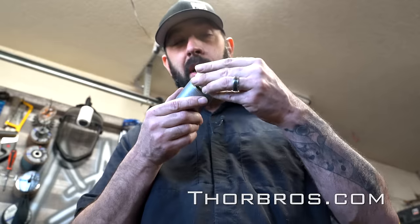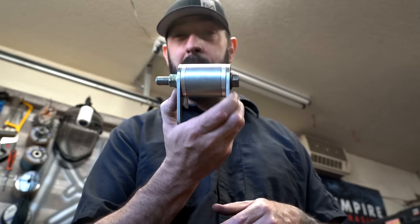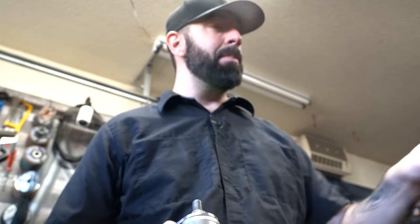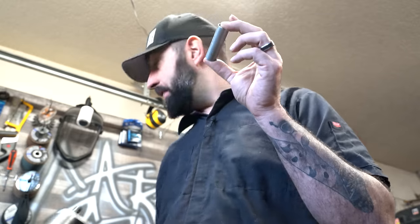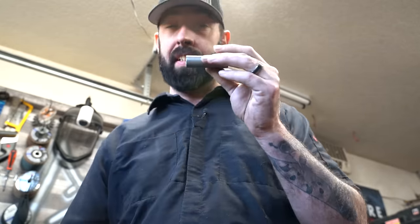You take the rubber out of the bushing and the aluminum mock-up bushings go in place. Then you can assemble the ears with the through bolt and weld everything together without worrying about the bushings melting. You do not need the mock-up bushings. You could just use the center sleeve, but it's important to know that if your edges aren't perfect, your ears won't be perfect either.